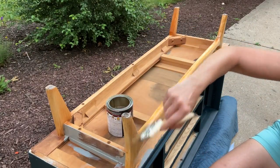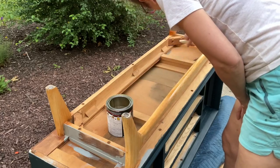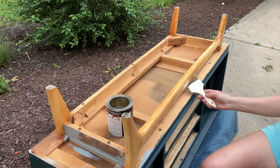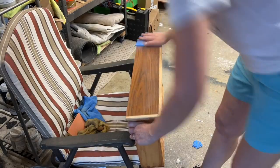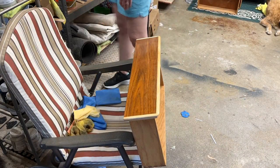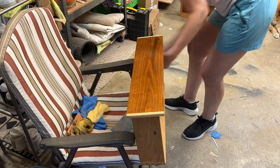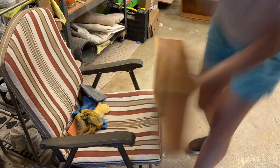Here I am putting that top coat on, and I'm putting two coats on the legs as well. Now if you haven't used finishing pads in the past, be sure to use those finishing pads between each coat of paint or top coat — your results will be phenomenal. It really is a game changer. You can find a link for the finishing pads in the description box below the video. Full disclosure, I am an affiliate for Amazon.com. I was so happy with those drawers once I put that top coat on — it made that wood grain pop. I also put top coat on the sides and edges of the drawer because I don't want anything getting caught on any pieces of fabric — just a smooth ride when you pull that drawer in and out.